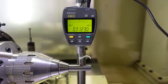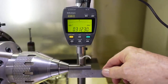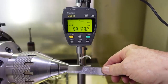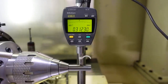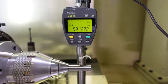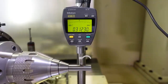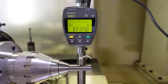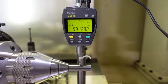I've got the 5/8 blank in the collet chuck here, and I stuck it out 2 inches. That's going to become important in just a little bit when we do the programming. And I got this indicator base on here, and I was checking the runout a little bit here to jog the A-axis. And it's running out of maybe a couple of tenths, as you can see there. A little bit less than that, maybe.